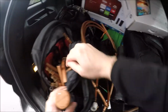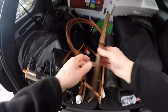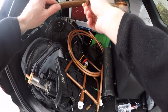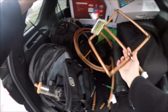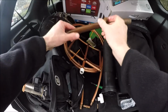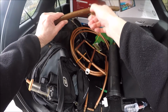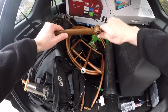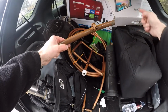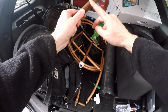Now, is there anything else I can show you? Yeah, I could show you one little thing. It's a little muddy, but we also have something called a QF header that they could have used in here. It wasn't specified. The way they did it was just like this. That's what they used, a grid, which is fine, but they could have used a QF header, which has an adjustable fitting. Look at this. You can put it any direction you want. It also has some bendability versus PVC, and these are at 12 or 18 inches on center, and this itself is at 3/4 or 1 inch, depending on the flow that you have.